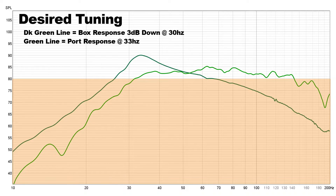The question is why is this really a problem? Ultimately, it's because we need a certain port length or size to eliminate chuffing because we are overextending our woofers into a frequency range that they are not efficient at. If you look at the TS parameters for the Tang Band 5¼ inch subwoofer, the free air resonance is at 45 Hz — that's generally where that speaker likes to operate. Since we want to have it hit a lot lower than that, I have the box tuned at 33 Hz, with a 3 dB down point at 30 Hz.